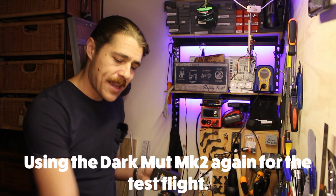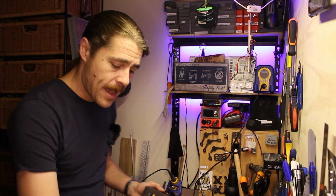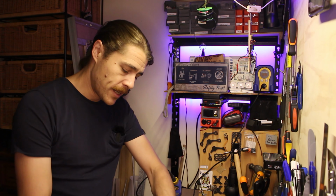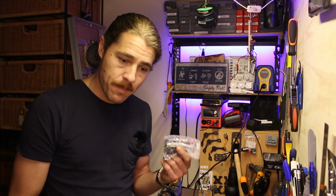This is a 30 amp and this is a 35 amp, so if this can do the freestyle, then this can definitely do it. But I do want to caveat that it's not disclosed, at least as far as I can see, by anyone who's selling these in packs. So let's have a look. These are only rated at a 30 amp and these at a 35 amp when there is an 80 degree Celsius cutoff in the system. So if you're going on a long range haul, you may get, I mean, it's highly doubtful with airflow and all that, but that's something you should consider.